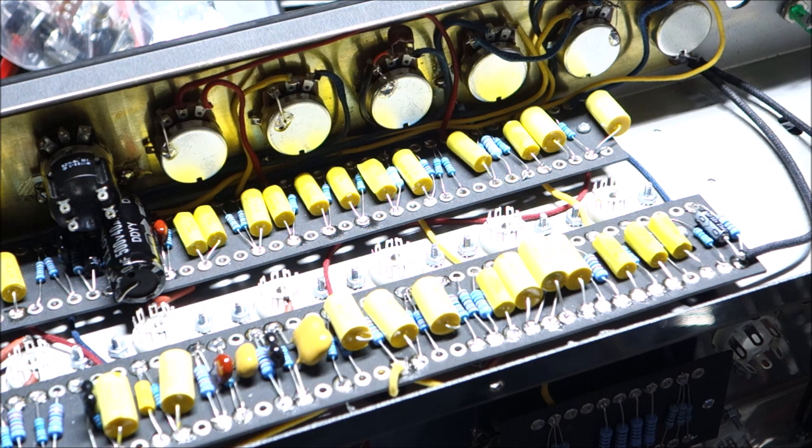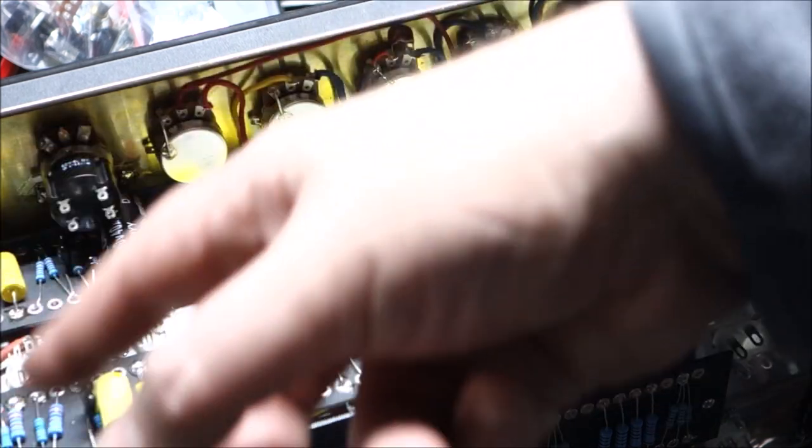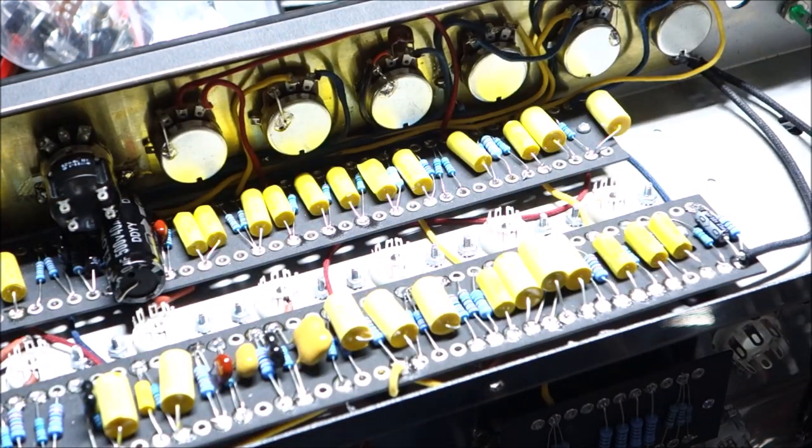I've used the little beeper, the continuity meter, to check, like on my shielded wire, that signal is getting from A to B and that the shield is grounded and that I'm going where I want to go, and nothing that's not supposed to be grounded out is grounded out. It's going okay. Gonna call it for today and keep going later.